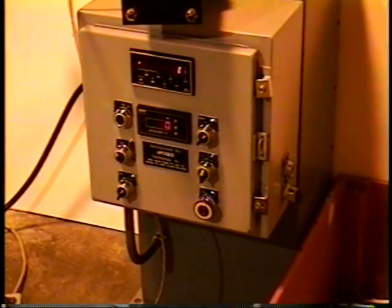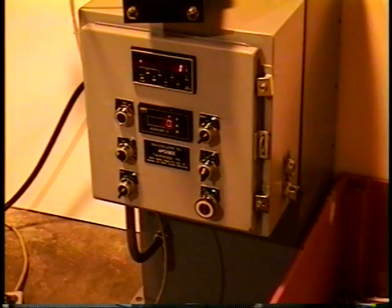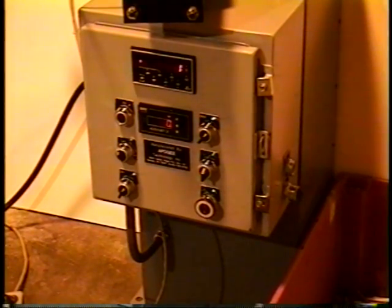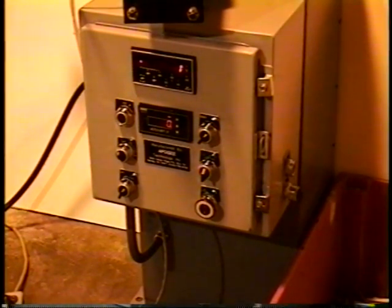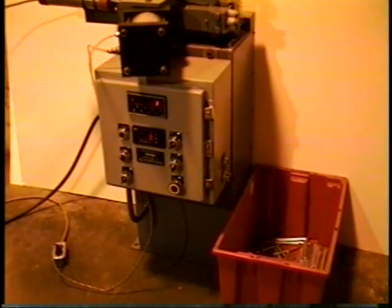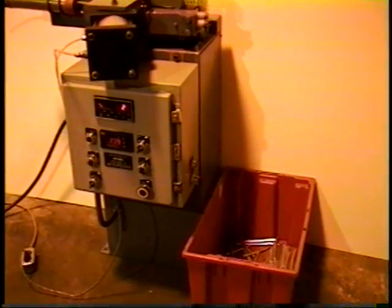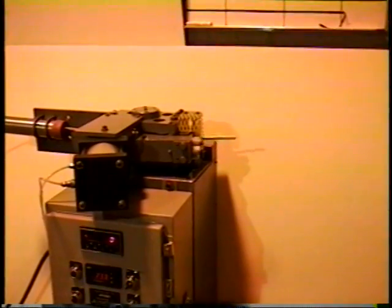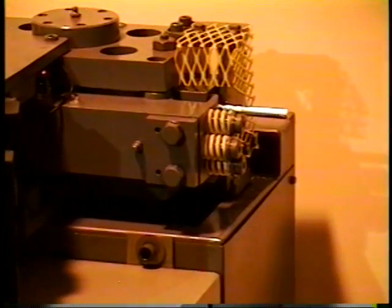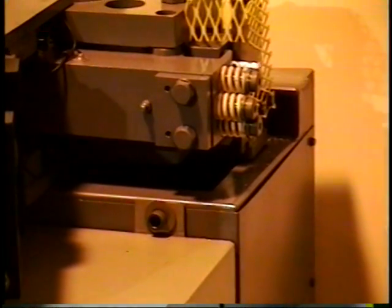We performed a statistical analysis over a sample of 50 rods and 50 cut sections, and we experienced a three-sigma relative standard deviation — that's at 99.7% confidence — of just under 2% variance, which is quite satisfactory. What we'd like to do now is engage it and demonstrate its operation.